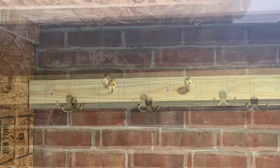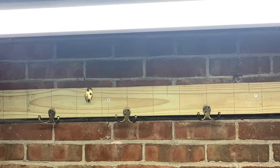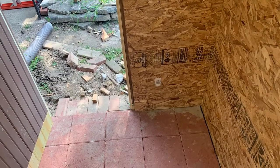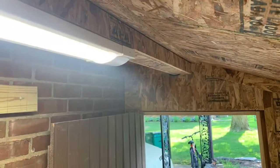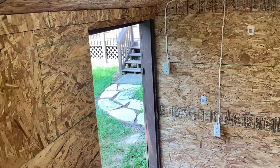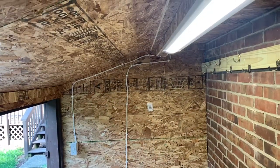I even made a halfway trim section out of OSB, just cut into two-inch strips to cover any and all spaces. You can see the bottom of the door there in that last picture — it had to be cut off and refit back in. A building that sits below grade just didn't do very good sitting in the water all the time.